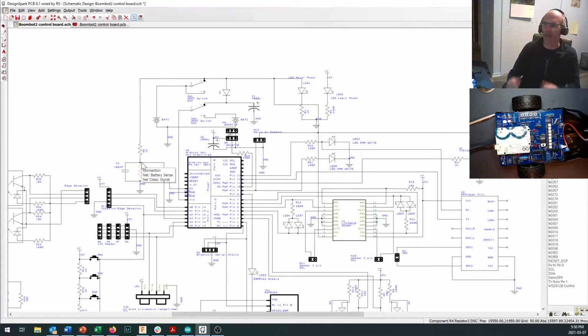You'll be reading a number that is half of the actual voltage because we have a voltage divider right here. We split the voltage in half, because the Arduino can only measure to a maximum of 5 volts. So this lets you use a battery up to 10 volts on here and still get real-time readings of what your main drive battery voltage is. So useful if you want to know, do I have fresh batteries